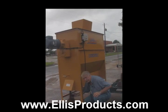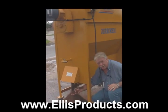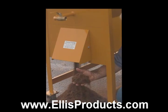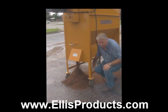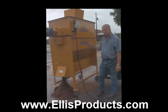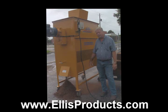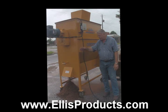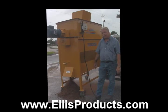If you look right here, you'll see this is just a perfect material because it has a 5/8 screen in the bottom. Any material in the Core Buster has to go through this 5/8 screen, so when it comes out it's actually perfect. Now the Core Buster 2 will do a metric ton in about 15 minutes. This machine will do a metric ton in about 35 to 40 minutes, so it's not quite as fast as the Core Buster 2. But you can run the material up an incline conveyor right out of here into a flat filler, a hopper, or whatever you want.